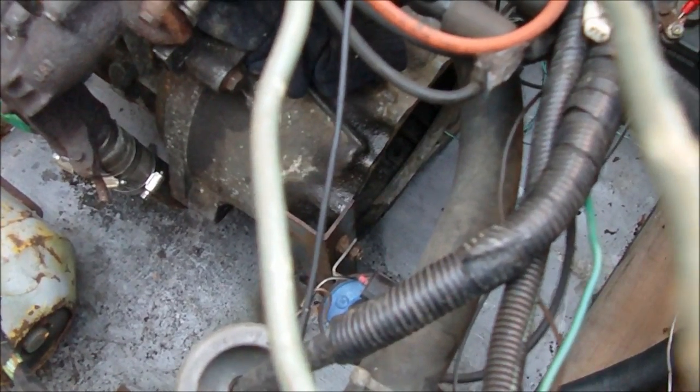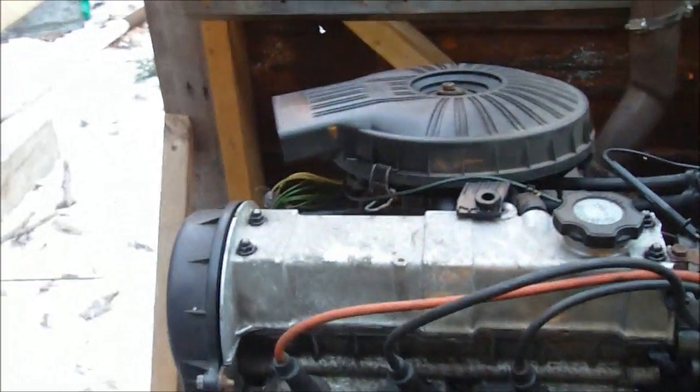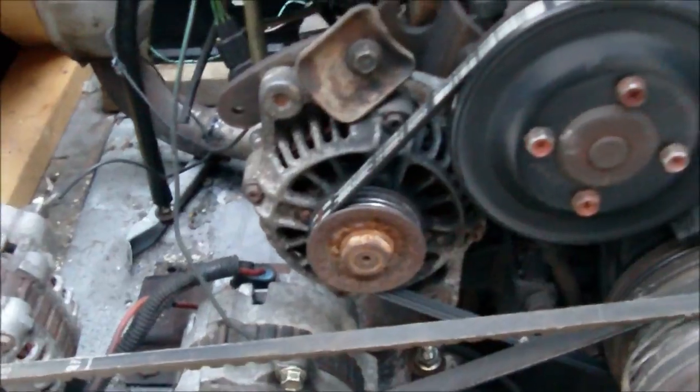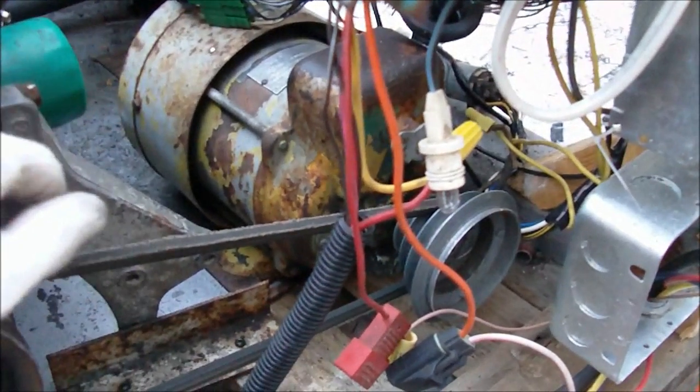The cooling fan is not working — I'm going to test the relay to see what's going on. The actual sensor isn't working, so I think this is definitely up to temperature. If you're going to be putting together a generator like this, you're pretty well safe with the alternator setup. But if you're going to be using an induction motor setup, then you're going to want to be experienced in electrical work and understand the safety precautions, because there's going to be about 120 volts there — could be more — and you'll have capacitors to maintain the field.